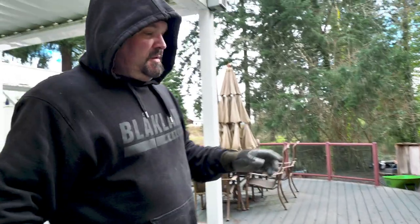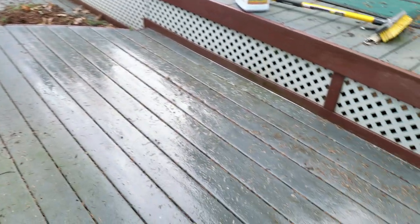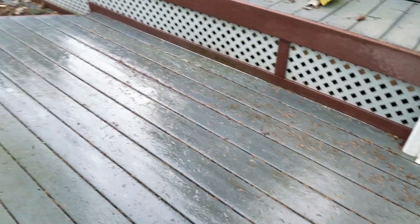I'm not sure yet if the moss just dissolves and goes away or if we'll still have to pressure wash. Once you spray the chemical, let it sit for a bit, then scrub and agitate it — that's what loosens up all the moss, mildew, and algae. It might work on some sap but I'm not guaranteeing it. You can already see this section of the deck is starting to lighten up before I even scrub it.